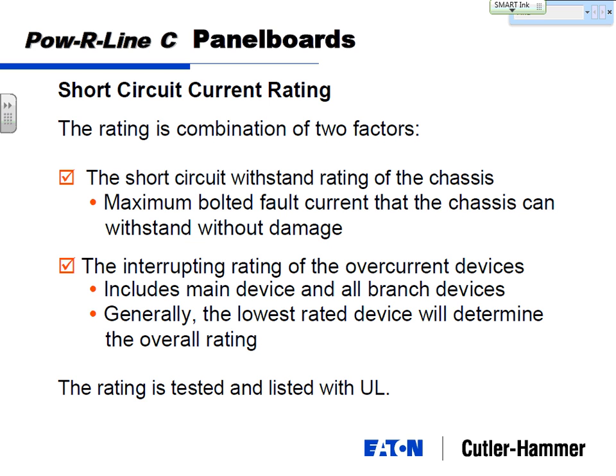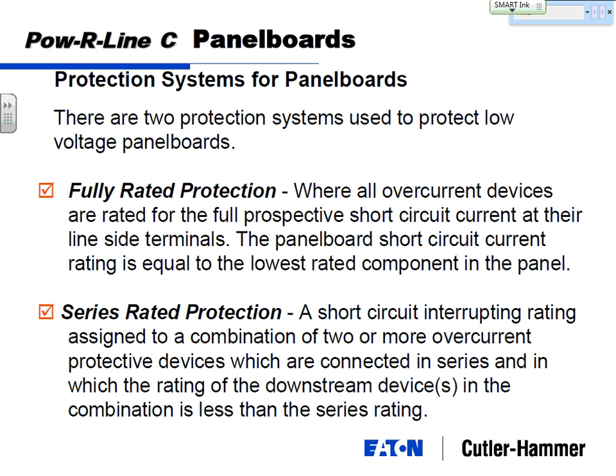Now, the second part is the magnetic part. The magnetic part is what deals with short circuit currents or higher value fault currents. The way the magnetic part works is like a coil. It's the theory of magnetics: the more current's going through, the higher the magnetic field you're going to generate, and the more that coil is going to move. When you hit a certain value, you're going to create enough magnetism to activate that coil and move it into the trip bar. So your thermal overload is slow speed over time, and your magnetic part, high short circuits, is quick speed. Any questions on how the circuit breaker works?